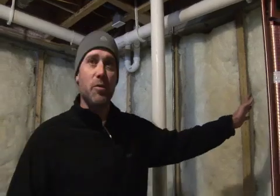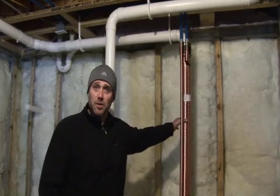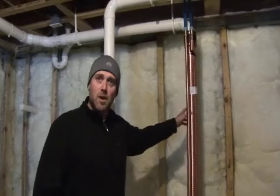What we have here is about a four-foot what they call a power pipe. It's manufactured in Canada. As you can see, it's copper, which is a highly conductive material. When heated drain water passes through this pipe, the conductivity of the copper will pull the heat from that water and recirculate it back to the heating mechanical system.